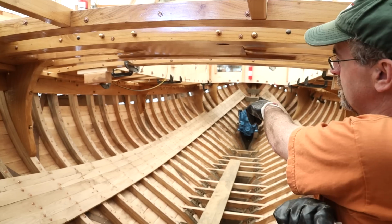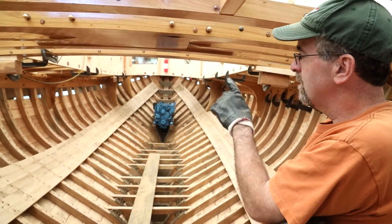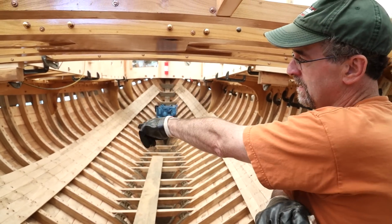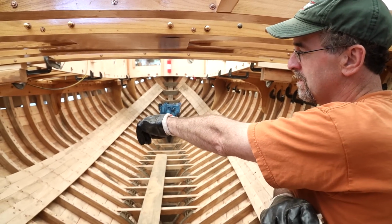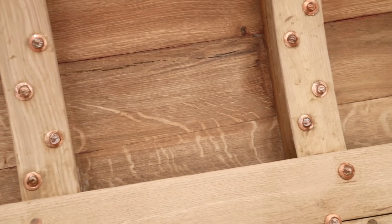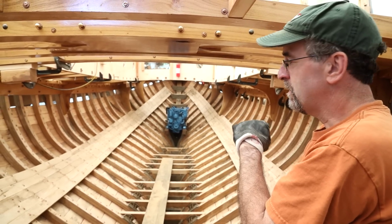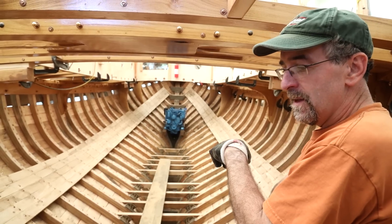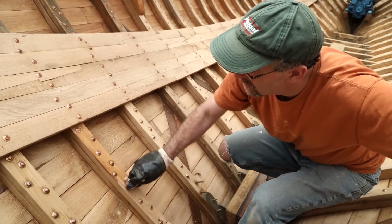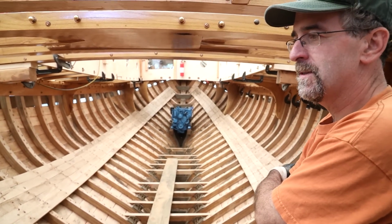When we were sanding the other day, Grant started sanding down there with the little triangle sander, and then I was working on this side and I thought, well, wait a minute, what's it going to look like if I scrape it? I was just scraping in this section and I hit that plank down there with that amazing figure in it, and all of a sudden it was like boom, it was hiding behind all the sanding marks. And that was the decision to say, okay, let me reach out to Steve and see if he could make a decision about, should we be doing this for all the areas that are going to be exposed? And the other part was that when we started to do scraping on these, we really started to see the grain of the oak come out. It was really obscured by the sanding marks previously.